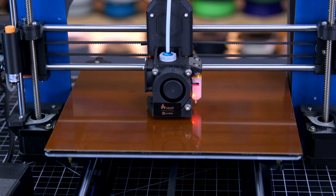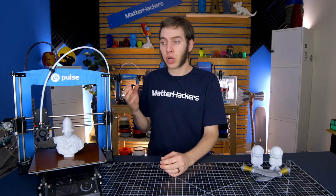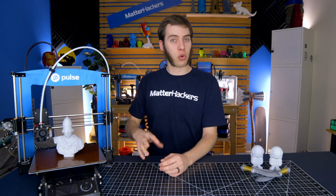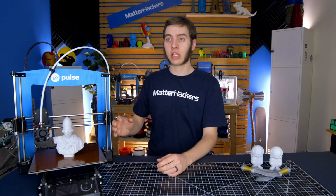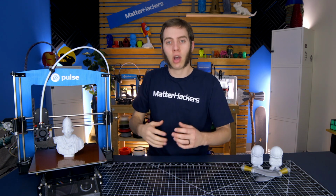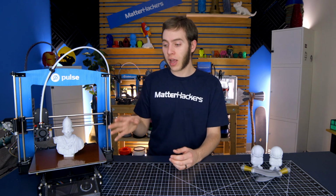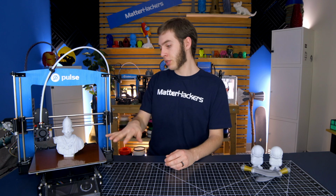And going back to the current being what gives the torque to the motors, if you're trying to put too much current in to move really quickly, that's giving it less torque. Moving very fast means it's basically just doing the best it can to get there, and if it hits something in the way, that'll cause it to stutter, and that's how you can get those layer shifts. So if you're printing just too fast in general, that's how you can get prints to shift.